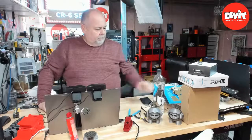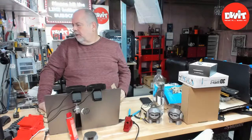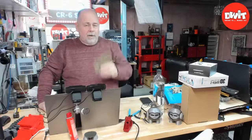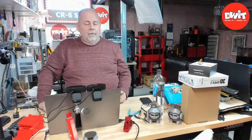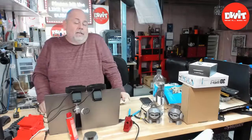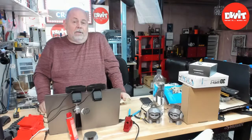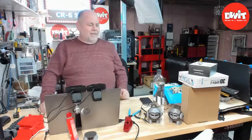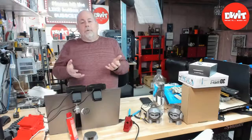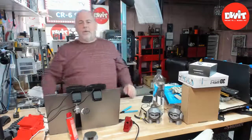Yeah, I'm really surprised, Brian, that you're doing that. Wow, that's cool. I'll have to try that with my one Ender 3 V2, the one that I have to use a knife to get it off, just out of curiosity, and see if I turn the heat bed off after the first layer or two, if they'll stick, because they're next to impossible to get off when it cools off. But as I say, I couldn't get away with that on my other one, because when I walk up to it after it's cooled off, I literally just pick the pieces up off the bed with no hesitation, no resistance at all.